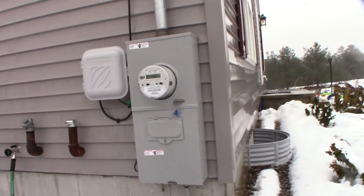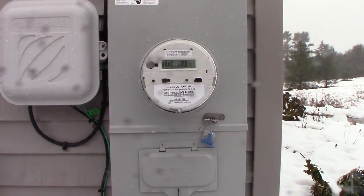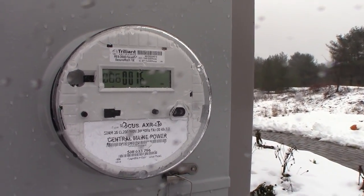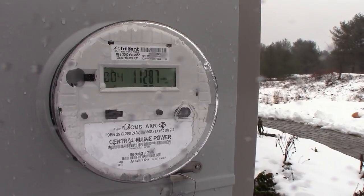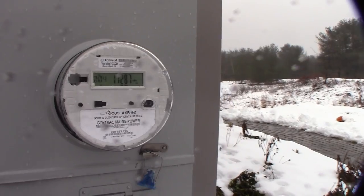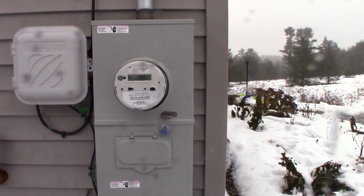It appears the house is all up and running — everyone's happy except the people that got pranked. Obviously the fridge is running, and I've got a downstairs fridge and freezer also running. We could run the heat if we needed to, so we wouldn't freeze to death. Now I'm going to show you how to confirm that your power has in fact been restored, and then how to shut everything down as safely as possible. We're going to go outside to where your power comes in off your pole — basically your meter box. You want to look at the numbers; if you have the new style meters, you'll see the numbers scrolling through telling you all the information. That tells me the power has been restored, so we're going to go ahead and shut the generator down and put everything away.